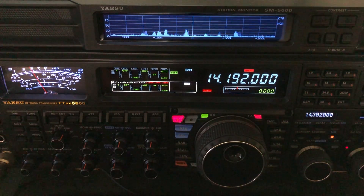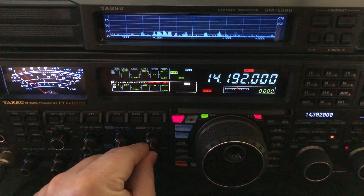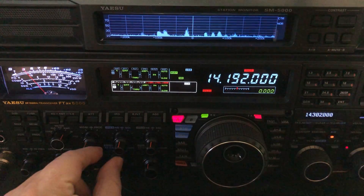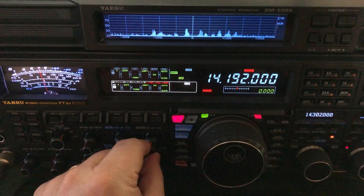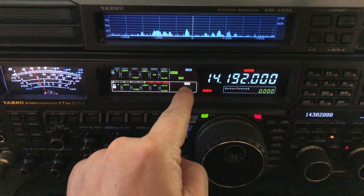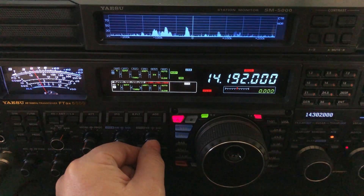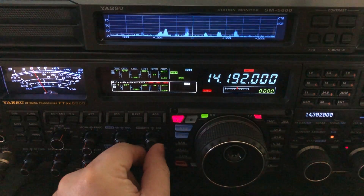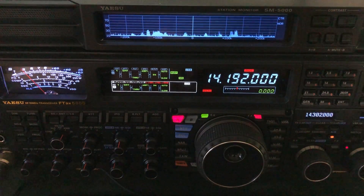See, noise is not down. There's a level adjustment right here — this radio has knobs. This is a noise blanker adjustment for VFO A and this is for VFO B. You want to run these at the lowest level that will take care of the noise. I've just turned the level all the way down. Now I'm going to bring it up just to the point where the noise goes away.